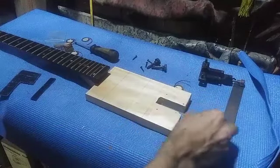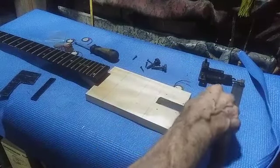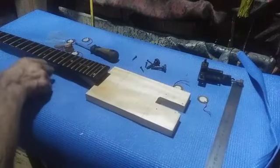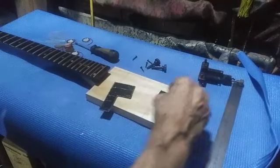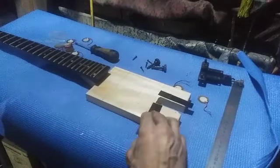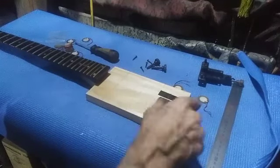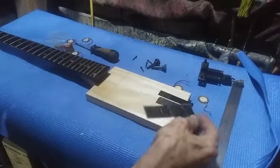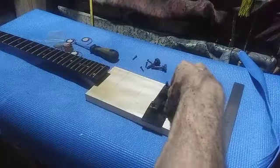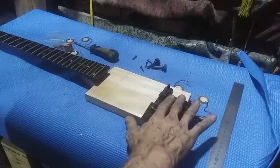But basically, it's going to get a little recess drilled in there, and there'll be a piezo on either side here, 10 millimeter, not these, which are like 27 millimeter. And then pickguard material is going to go over top, and on this side it's going to stick out a lot, all the way over here, because it'll have the switches and the EQ mounted to it, so it'll be a big plastic plate like this kind of thing. And the bridge will mount right onto it. Like that. So these two pieces of pickguard material here will account for that difference in height, that thickness.